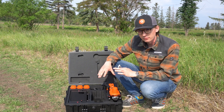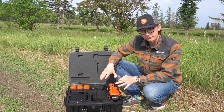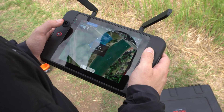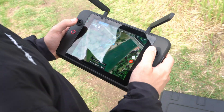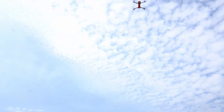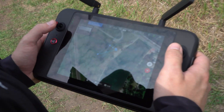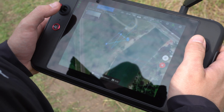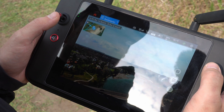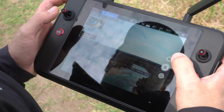All of that is irrelevant if you crash the drone, so how easy is it to fly is probably what a lot of you are asking. The good news is it is incredibly easy to fly and incredibly easy to set up the mission planning. All you need to do is throw a battery in, you're connected in 30 seconds, you can get the RTK going in a couple of clicks and then take off and start flying. The mission planning is incredibly easy — all you have to do is draw your shape, it automatically picks the routes, you can change the angles, the overlap, any of that with a couple of clicks.